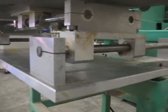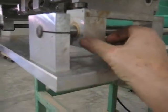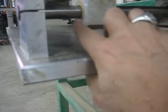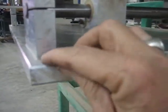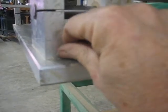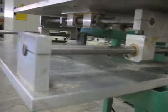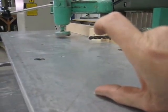Make sure that when you now have the center down here somewhere, you need to have enough clearance under the shaft for this. It looks to be, measures out to be about the same amount you would have. Worst case is you might have to put an 1/8 inch spacer or something here, so you'd end up being just shy of 3¼ inches from your bit center to your tabletop.